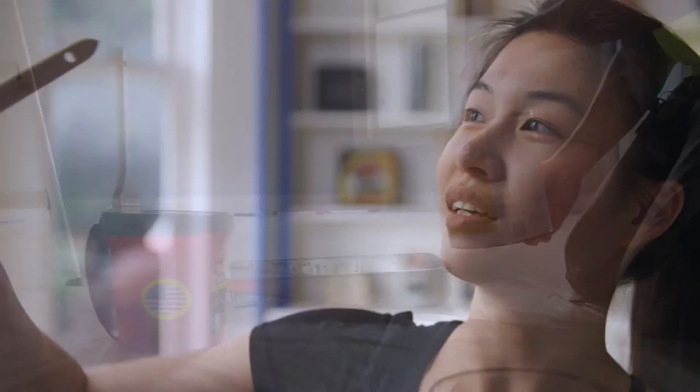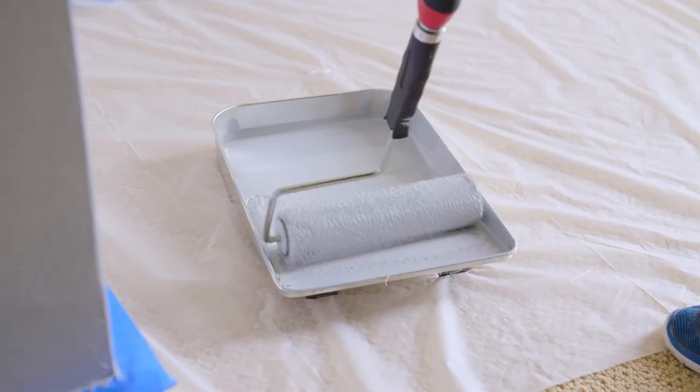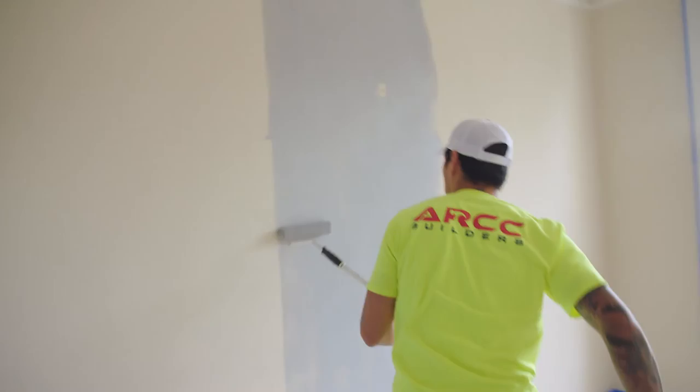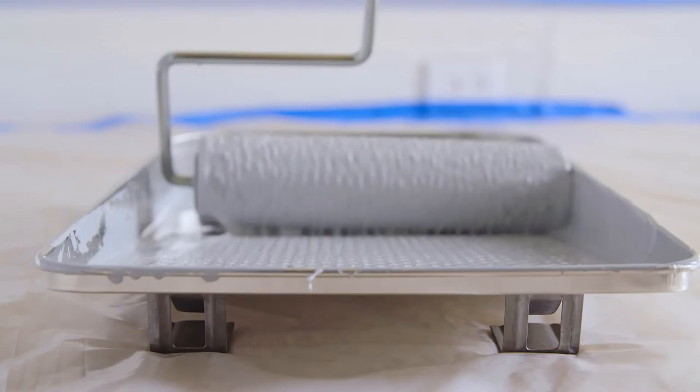Once completed, dive right into rolling and paint all the walls. Roll your roller brush into the paint well of your roller tray, then roll a couple times on the upper part of the tray to remove excess paint. Roll the paint onto the wall in a tight W formation — envision a long, tall zigzag with no spaces in between that runs from top to bottom and back to the top. If the roller feels too wet, your paint will go on too thick. Try rolling off the excess paint into the roller tray. Make your way around the room, one wall at a time.